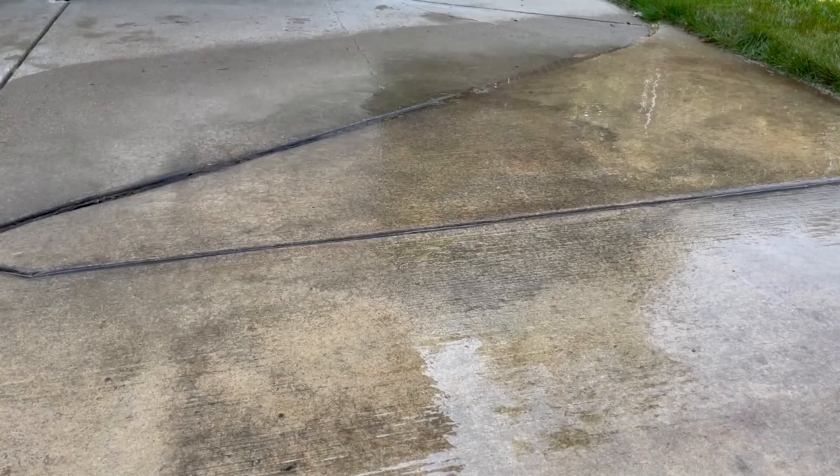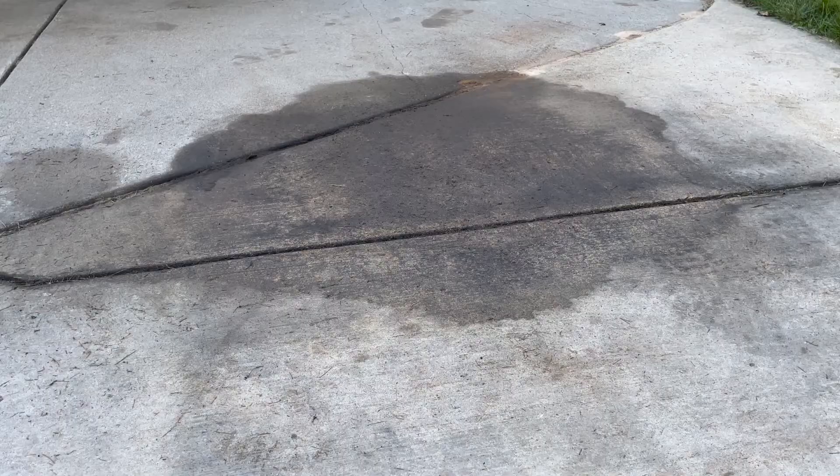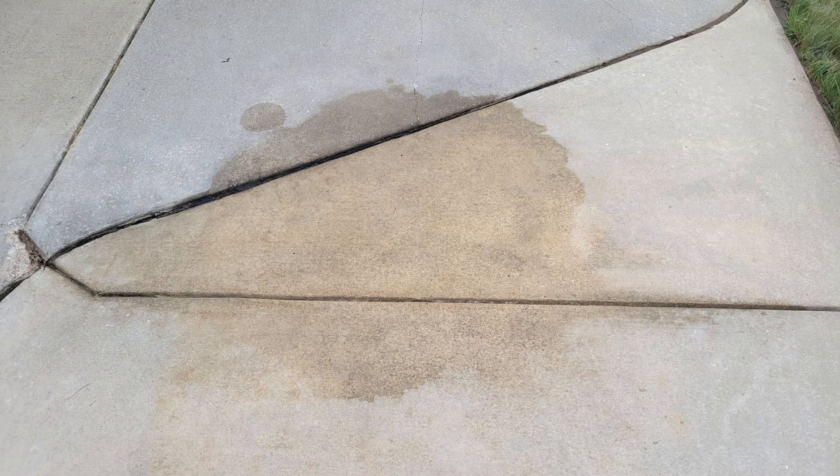Now we've let that sit for a while, let's go ahead and take the hose and spray it off again and see if there's a difference. Not too bad for an oil stain that was on there for many years. There's still a little bit of trace stain in the concrete but all the oil is definitely lifted off the surface thanks to Release. I wanted to provide a before and after picture — we did end up going back with a pressure washer and that helped get the really deep stain out of the concrete. Here is what the stain looked like before Release and the pressure washer, and here's what it looked like after when the water had all dried. Release did a great job of getting the oil off the surface. That was our 20 to 1 dilution, which is the strongest concentration of Release I would recommend using. Thanks for watching today's video — check out some of our other videos and have a great day.